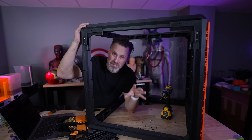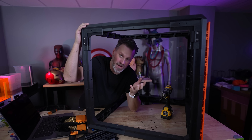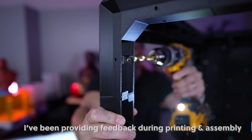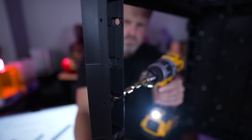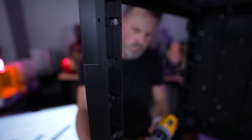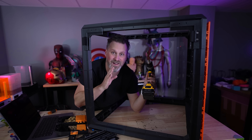For this next part I need to mount the pegboard to the side panel, where I'm going to insert some nuts on the backside of that panel and then feed screws from the front side through some openings in a few strategic areas — not every single opening, just a handful of spots. This is a great reason why I'm making this video: I'm running through and testing all these files before you get them. I found another issue — a hole opening in some of the frame parts for mounting the door is too small, so I'm having to drill those out. I've already sent a note to them about making a change to that.